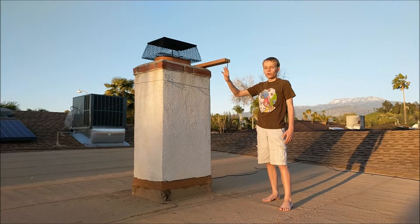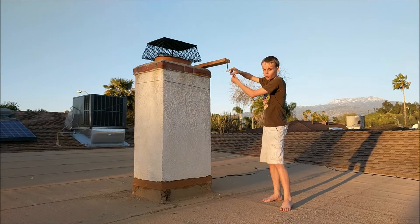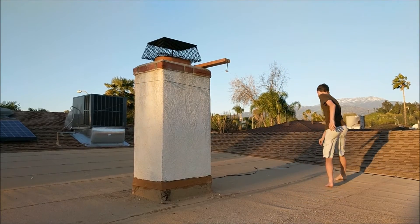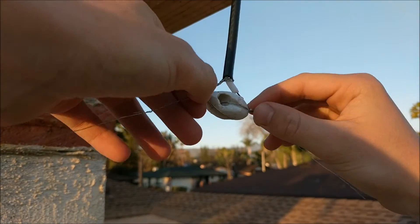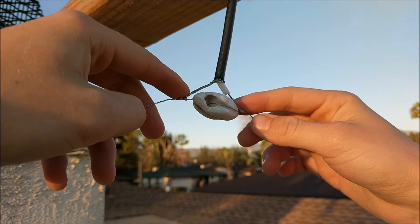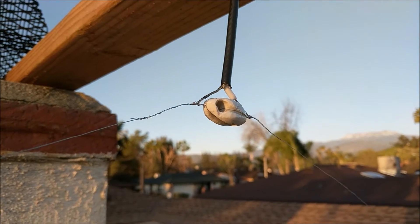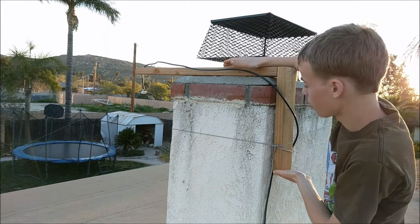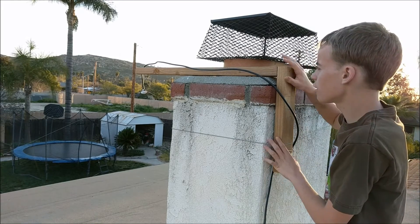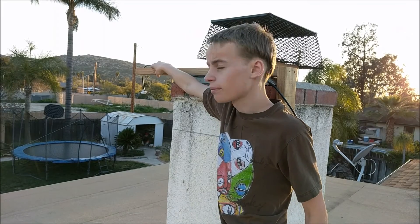As you can see, I have placed my dipole antenna right up here on the chimney. In the center is a ceramic insulator, and it has exactly 8.2 feet of 26 gauge steel wire coming down to another insulator. This small ceramic insulator has two pieces of steel wire tied around it so that they are not touching. Each part of the coax is soldered to a different wire coming out from a different direction. This coax is hanging directly from a piece of 2x4, which was bolted to another piece of 2x4 in an L configuration, with a piece of rope holding it tight to the chimney. The coax cable runs all the way down the roof and back to my room.